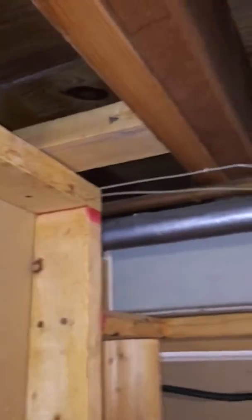We'll also be adding a vent to the main floor, and that's in this workout room right here — it'll be right up in there. Looking at the duct work, it'll be right along this area. I'm thinking a 4x10x6 torpedo boot, 6-inch takeoff, and probably 10 feet of 6-inch pipe with our 4x10 brown floor grill.